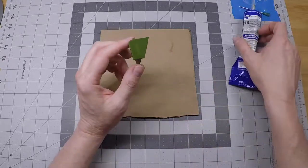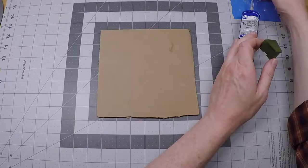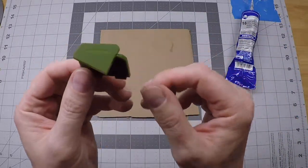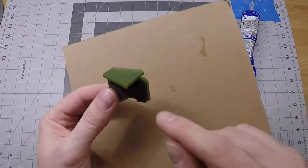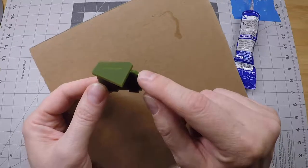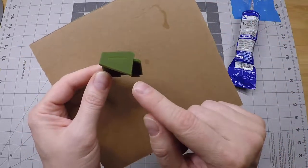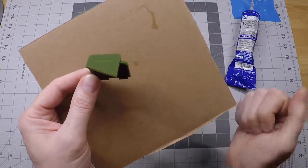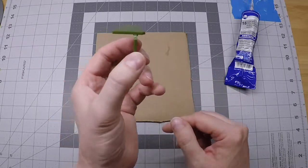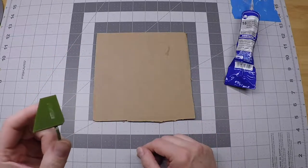And it's worth noting that this also is a part that has an acceptable tolerance built into it, so you don't have to worry if things aren't absolutely precise in terms of alignment. But you do have to worry that things are absolutely precise in the way this is put together, with this sheared off corner of the stand to my right, and then the pointy part of the coin sensor also to the right. So this just needs a safe place to sit and cure so that it doesn't get its shape disturbed. So I'll go set this up somewhere and we'll move on.